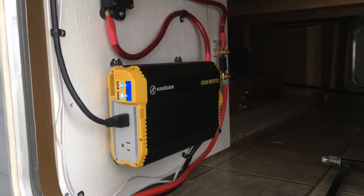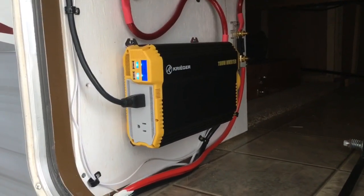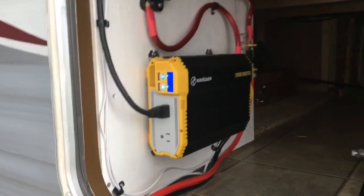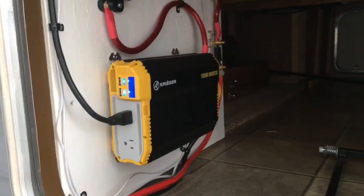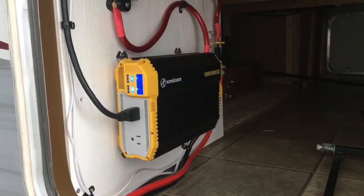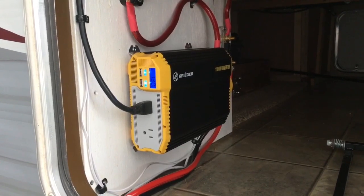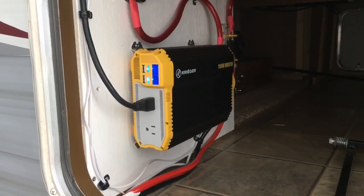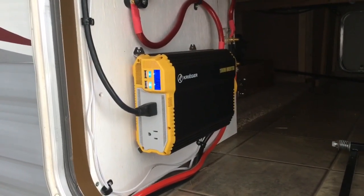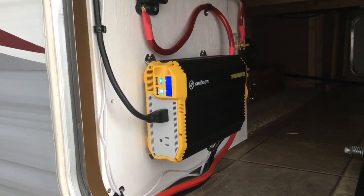There you have it — it's not too difficult to run all your RV outlets off your inverter. It's actually quite simple, especially if you've got a breaker you can flip to turn off the charger. If you don't, you'll have to run something similar to what I have, or accept that you're going to drain your battery much quicker because you're in that loop cycle with your charger. If you have any other questions about this inverter, feel free to reach out, and we'll talk next time.